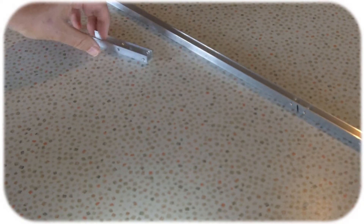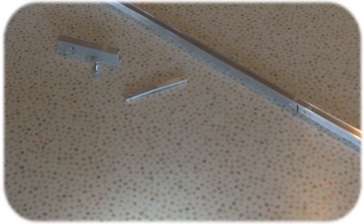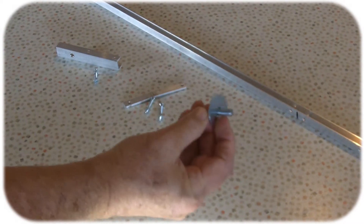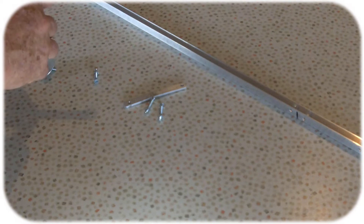That larger piece is about four inches or 10 centimeters. You're going to need a bolt to hold the two pieces together. You'll also need a little piece of aluminium flat strap — again about four inches — and two bolts to go with that. You're also going to need a quarter-inch screw and a washer, because there's a quarter-inch hole drilled in that piece as well.